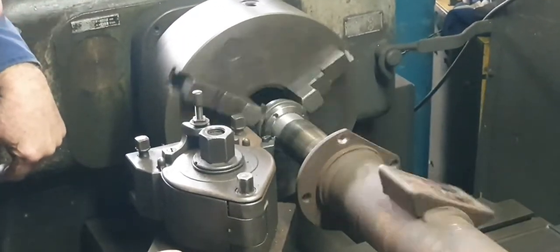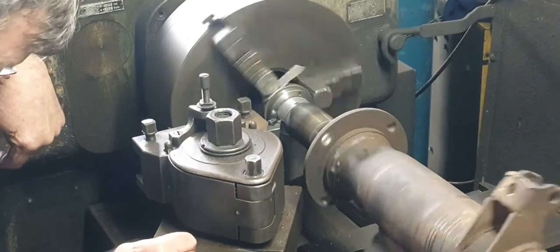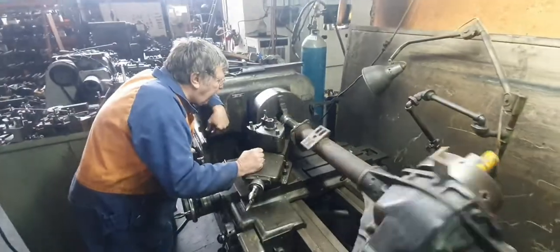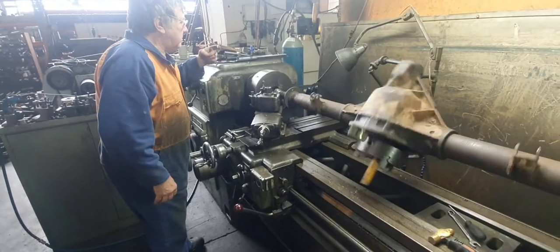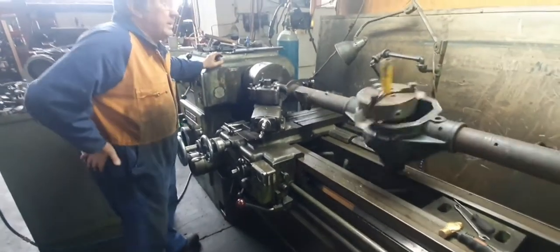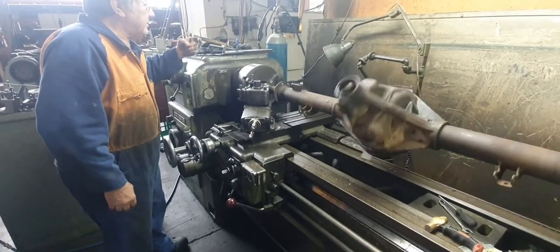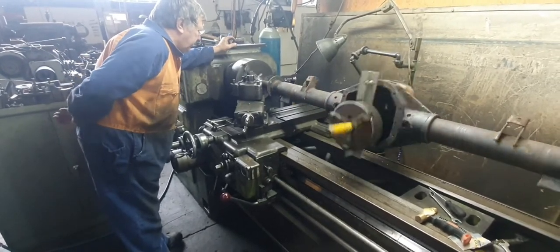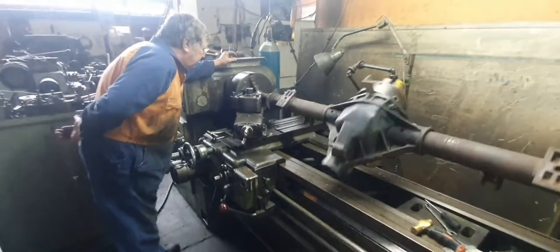We're out to lathe this. German lathe. Good lathe, powerful. It goes 7 revs a minute, this lathe. Try out. What would you need to do that for? About 9 seconds, one breath. Why would you need to go that slow? Well, you might have to screw cut a bit, a triple start thread on a big screw.